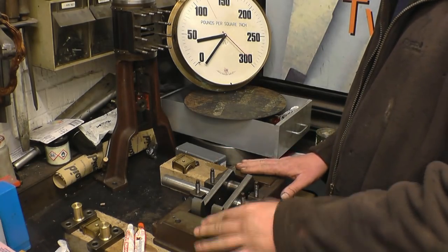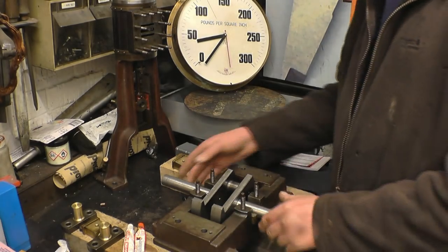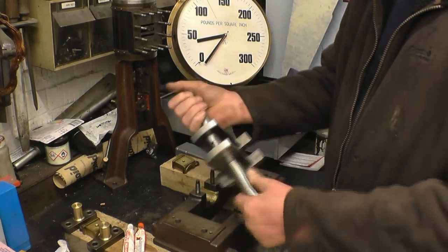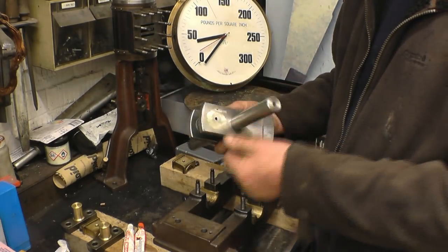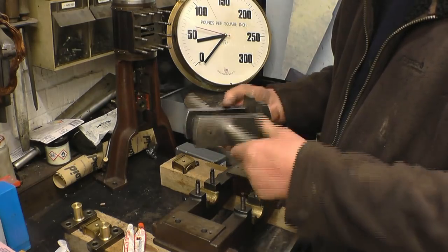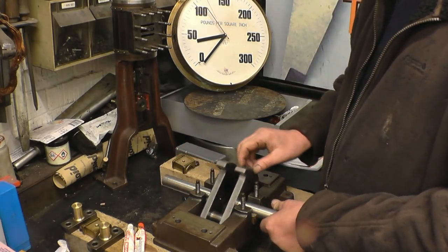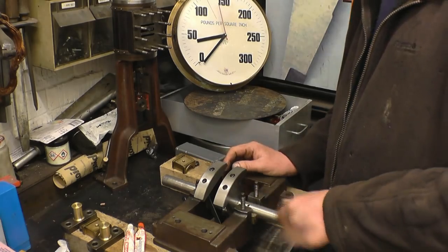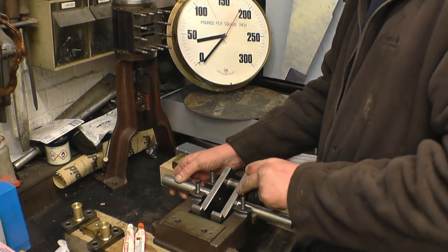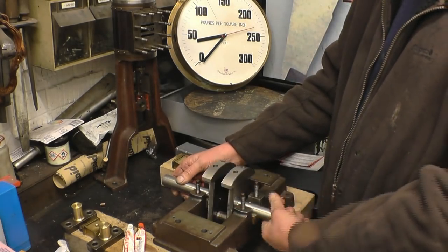I'm going to assemble the bottom end of the steam engine for real now. I've decided not to paint this casting — just wash it off, oil it, and leave it the way it is. When I made the crankshaft, I put a drilling in there, and the crank is actually cross-drilled into the big end, so the oil feeds the big end from that main bearing. What I need to do is fill in those oil drillings with some twin-pack epoxy, which means if I ever need them cleared, an airline would blow them out — there's no pressure on there, it's just lubricating oil running through. So the first thing is to wash the galleries out, get them nice and clean, then put a little bit of twin-pack epoxy in the two holes to stop the oil from leaking out.